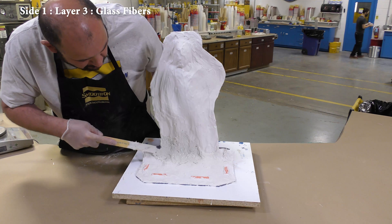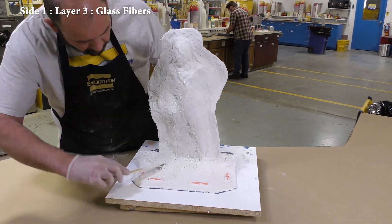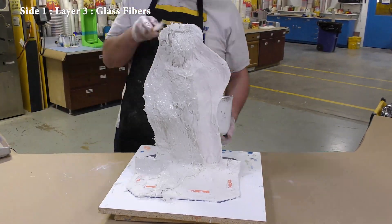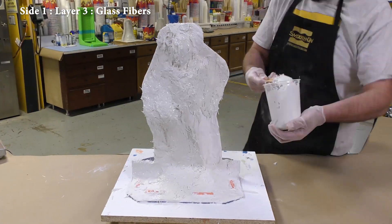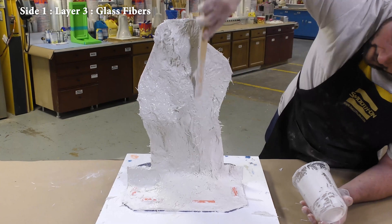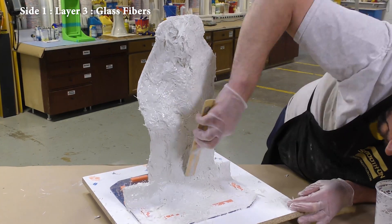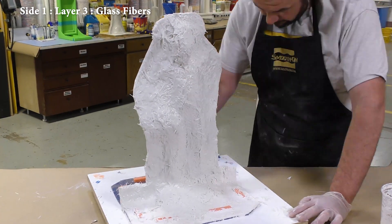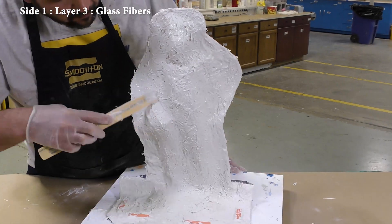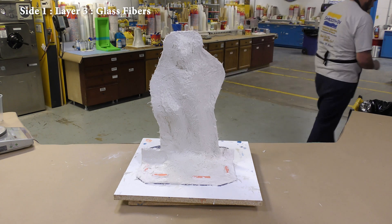The material holds a very good vertical surface and can be brushed up using a mixing stick. Make sure you apply the reinforced layer with glass fibers all the way to the edge of the support shell build-up to ensure consistent strength throughout. When glass fibers are encased in a casting medium such as the Duo Matrix Neo, they cure into a much harder surface overall due to the stiffness given by the encapsulating material. The material is now allowed a partial cure of 30 minutes.